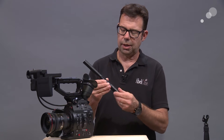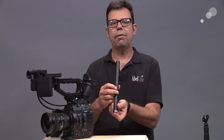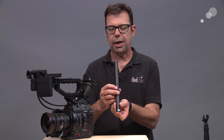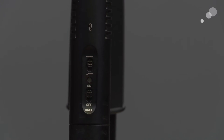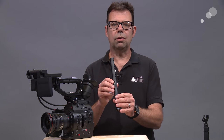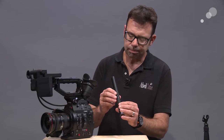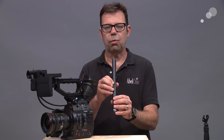There is an on-off switch because I have the battery in it. When I flip the switch up, a red diode turns on that tells me the battery status. That momentary lighting up of the diode indicates the battery is in good status and I should get a good long runtime out of it. Just above that is a filter I can engage to help take out low frequency rumble.